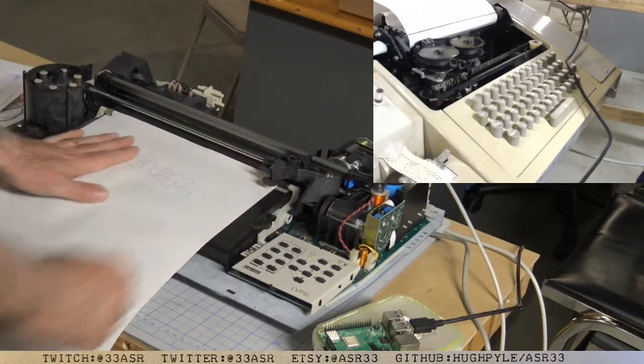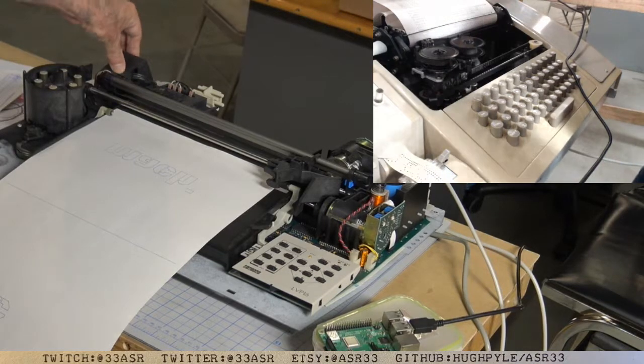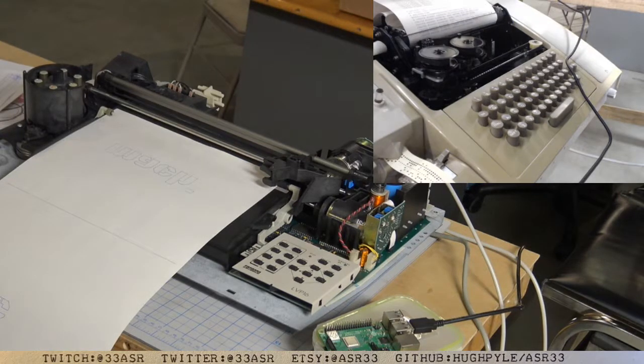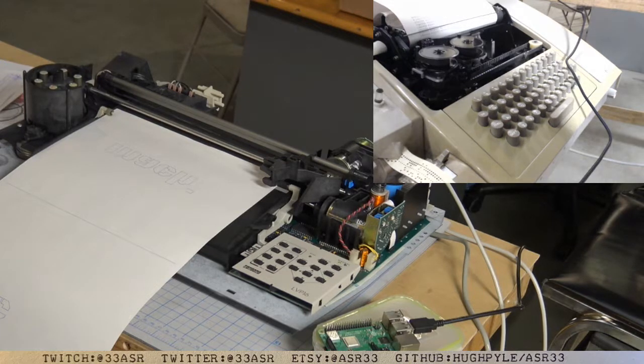Many kinds of failure. So I wonder what the error is. I think the error might be more significant than it's been letting on. I've been dreaming that the error is like a software thing. What if the error is actually my flow control to the device? Maybe I'm just saying cat, and it is horribly too fast, and my flow control's not working, and so the document gets corrupted once the buffer gets full. What if that's the case?